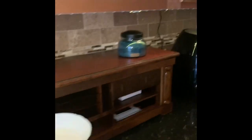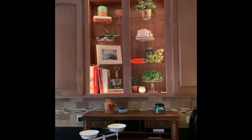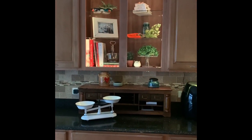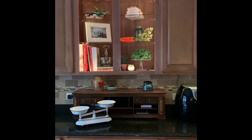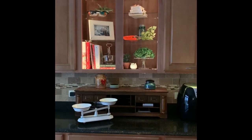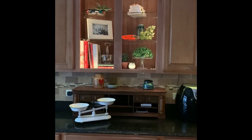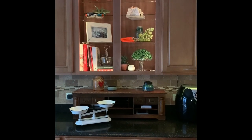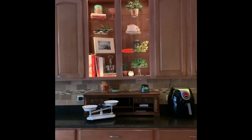I hope you liked this project and it's something you'll try to do yourself in your own home. Very easy — take the cabinet doors off, clean it, wipe it down really good, chalk paint it or use regular latex paint or even acrylic paint. Then wax it, put the lights in, order your glass, put your glass in, and there you have it. Thanks for watching — I hope you really enjoyed it.